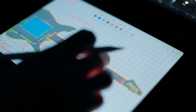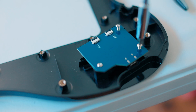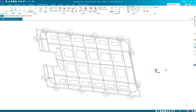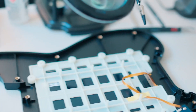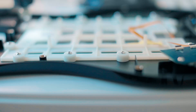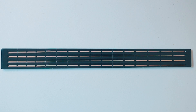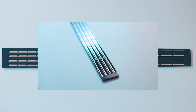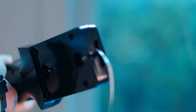Finally, the assembly. First, we need a body — the top face holds the electronics, and ultrasonic threaded inserts are used as screw holes. The second thing we need is a bracket for the touchpad, to get it flush with the body. Light pipes channel the LED light to the surface. We also need a protective overlay for the neck circuit, since we can't be touching raw circuit boards with our human hands. Last, the neck housing to hold everything together. Now to finish assembly.